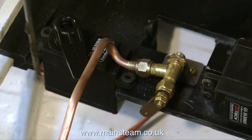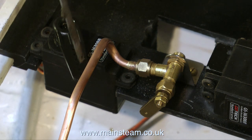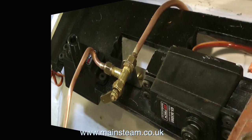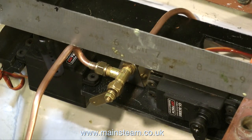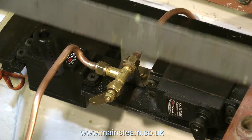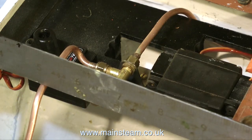I don't have a lot of clearance. I'm using 5/32nds of an inch pipe, which is a bit stronger than 1/8th, but it must not protrude above deck level — I'm checking this with a ruler — and it must not foul the servo which will be controlling the rudder.